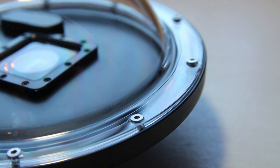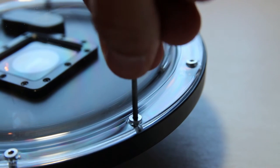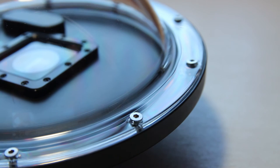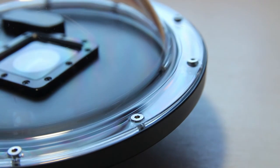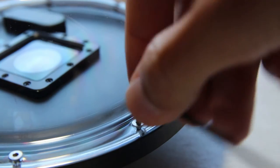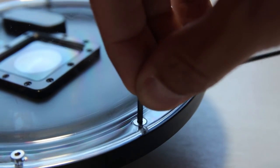The last thing I want to show you is how to remove the dome from the back plate in case you want to clean it from the inside. You will need a number 8 Allen key to remove all 10 screws that hold the dome in place. Use a microfiber or similar gentle cloth to clean the dome. Before you reattach the dome back to the back plate, make sure that the rubber gasket is in place and clean off any debris. Then tighten all the screws until you get some resistance, but don't over-tighten them because you can damage the thread.